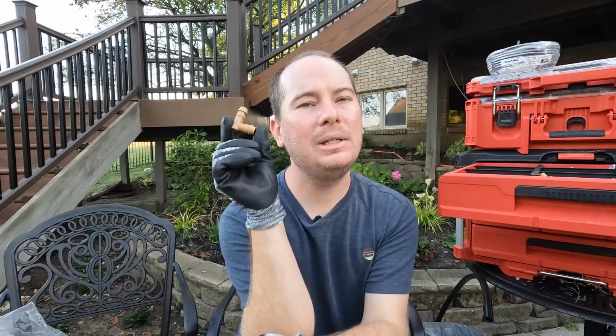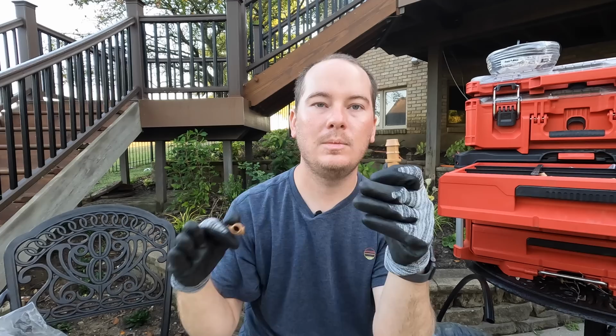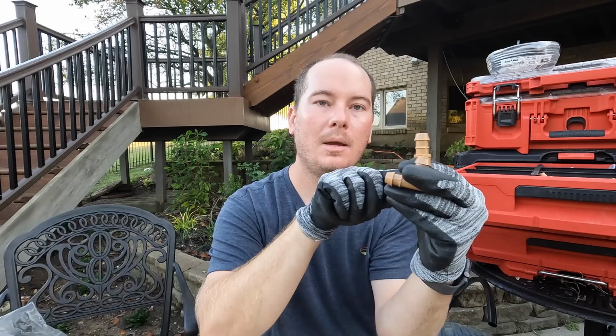I like to use these when I come down from the hose bib because it goes down to the ground, and sometimes you don't have enough room to bend this tubing at an angle, because it can be pretty rigid and you don't want to kink it, because this stuff kinks, and it's difficult to get the kink out of it. It has kink memory because it's just a plastic. So this I will use, and it will go straight to the ground, and then parallel along the ground the pipe will run, which is really helpful.